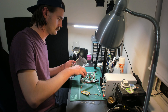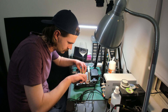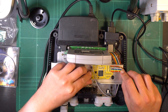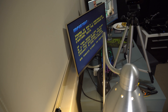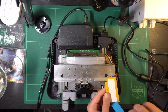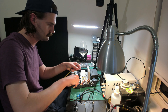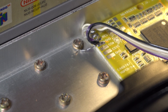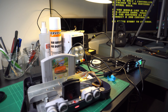Let's finish off this installation. The installation instructions recommend bending back the tab on the RF shield so the 12-strand wire can easily be channeled around the case. The idea is that the mod chip goes on top of the heatsink, and there's a bit of adhesive that can be pulled off to stick it into place. I performed another test just to make sure none of the wiring had been compromised, and it showed everything was still working. So let's pull off that adhesive — it is heat resistant, so even though it's mounted on top of the heatsink it should stay in place. The last bit of wiring is just a better ground connection — strip a wire, solder it to the ground tab, and wrap it clockwise once around the closest screw. After one more quick test confirming everything still works, let's put the case back on.